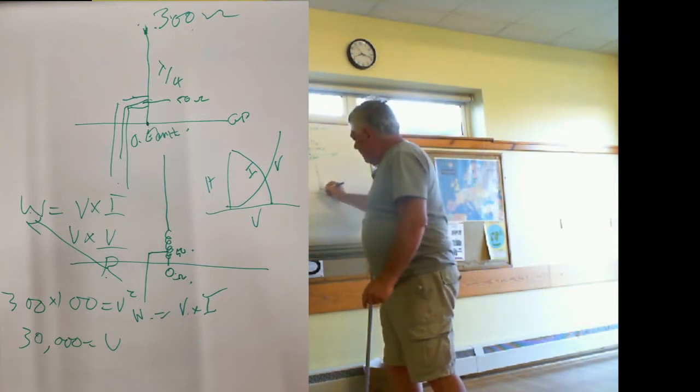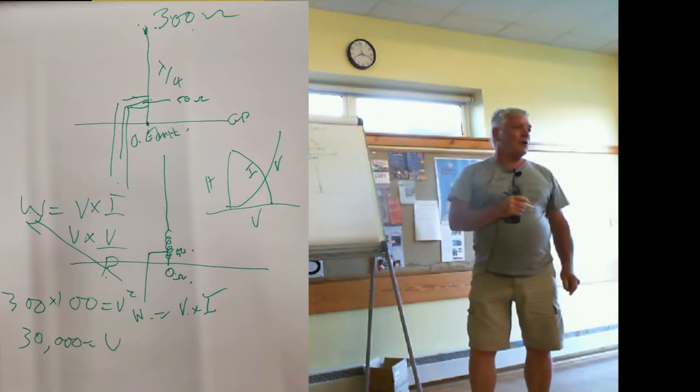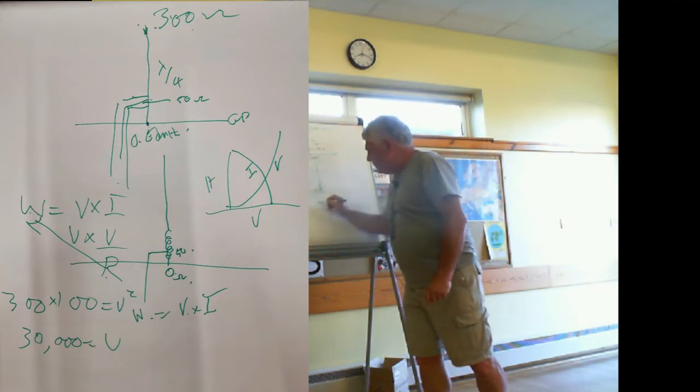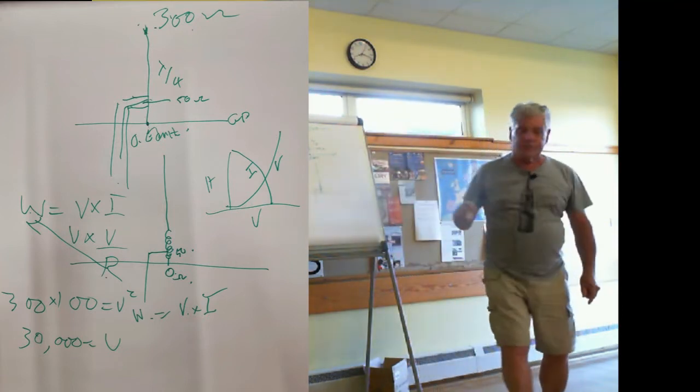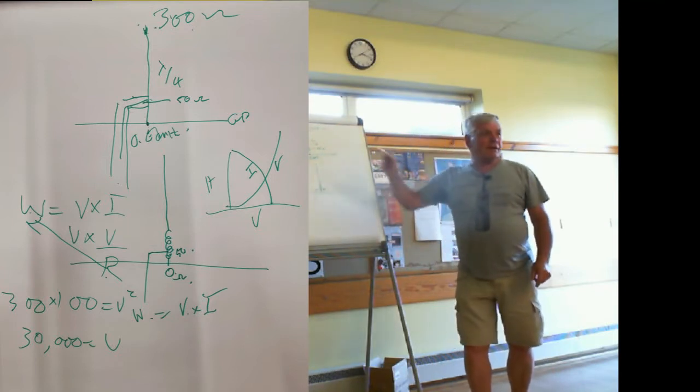we can do that. We can put a bit of coils in, and now our 50 ohm point, if you like, comes out there. I'm not going to do all the coax cables, but we'll just assume there's our 50 ohm point. And this thing is now a little bit shorter.